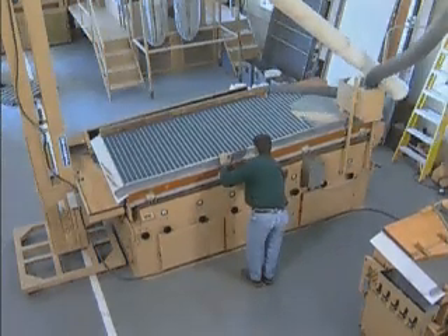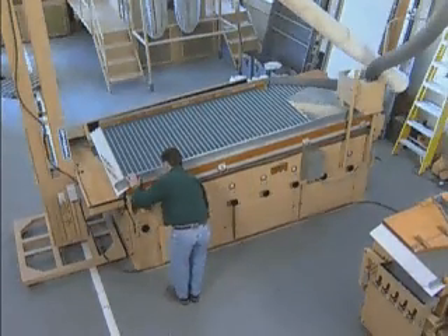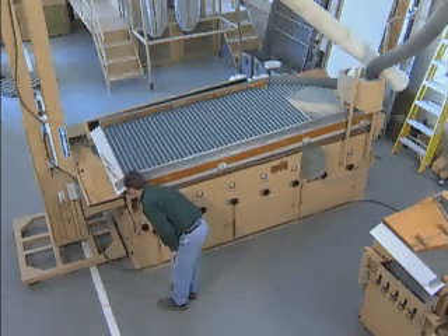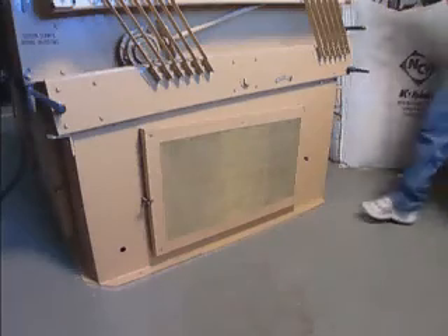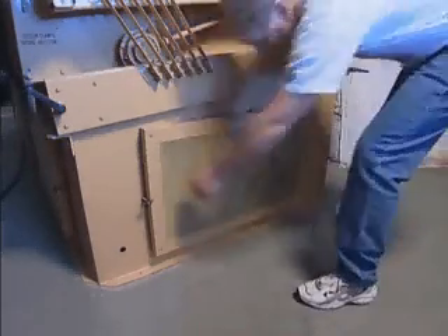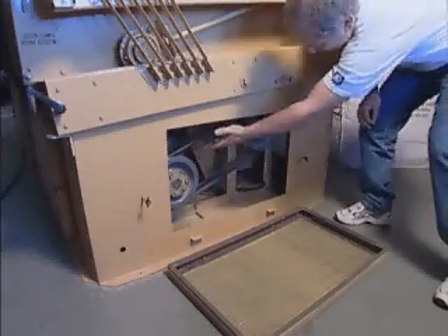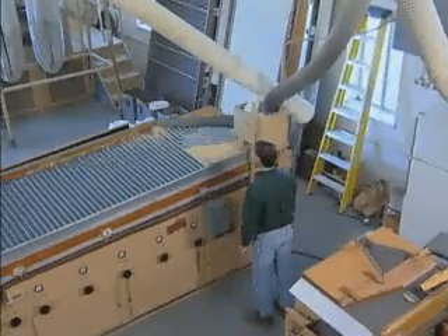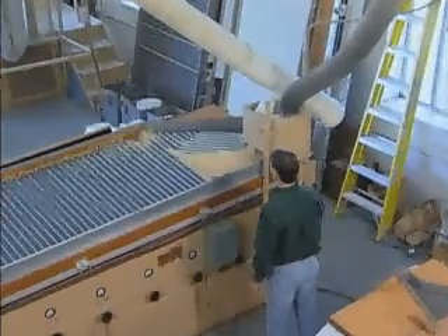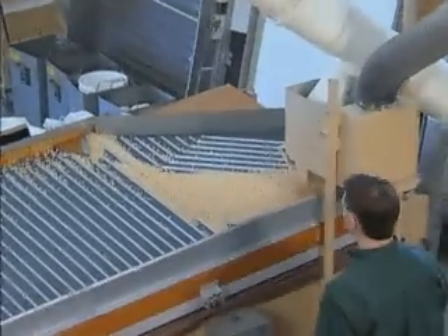Many of the initial adjustments must be made soon after material is fed onto the deck. Therefore, it is a good idea to operate the machine empty for a few minutes, making some preset adjustments. Presets are recommended on page 12 in your operations manual. Before turning on the machine, make one final check to be sure the fan shaft is turning in the right direction. All shafts should turn clockwise when viewed from the end of the machine where the motor is installed. Now that you are familiar with the control features of your machine and have preset all adjustments as suggested in your operator's manual, you are ready to start making separations.